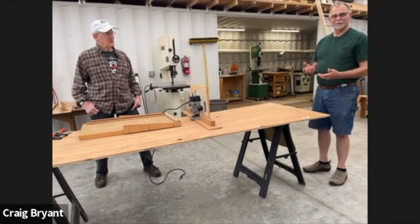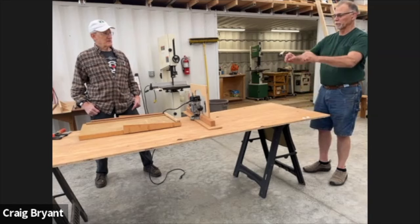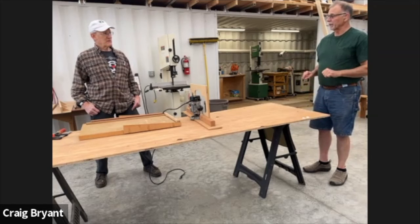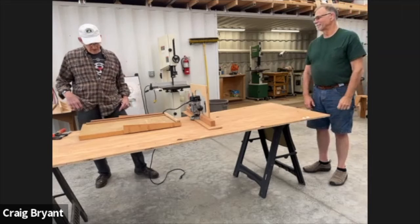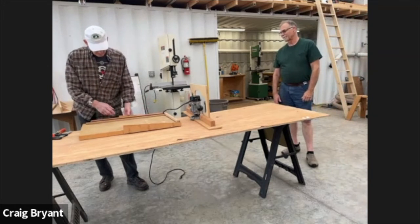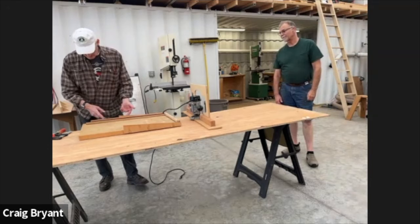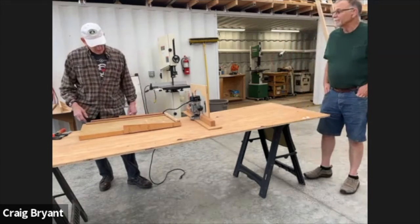And that's when you're doing a 12-to-1 scarf. If you've got 12 inches of sled, then you can only do 1 inch thick lumber. So it was purpose-built. If I want to do longer, or if it was thicker, I'd have to have these longer, or have these come up higher.